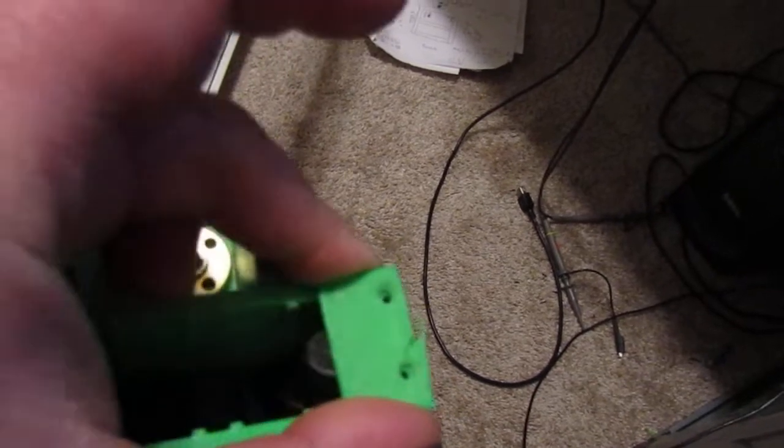And then also, there's a little plate. I gotta make a new one. I didn't have the holes big enough for the screws I used, and I split it, so I gotta make a different one. But that goes right about here. And since this is all tight tolerances, this will help keep it perfectly aligned and keep it from vibrating in there. And yeah, that's the design. I'm going to do that for all of my linear bearings, they're all going to be made like this.